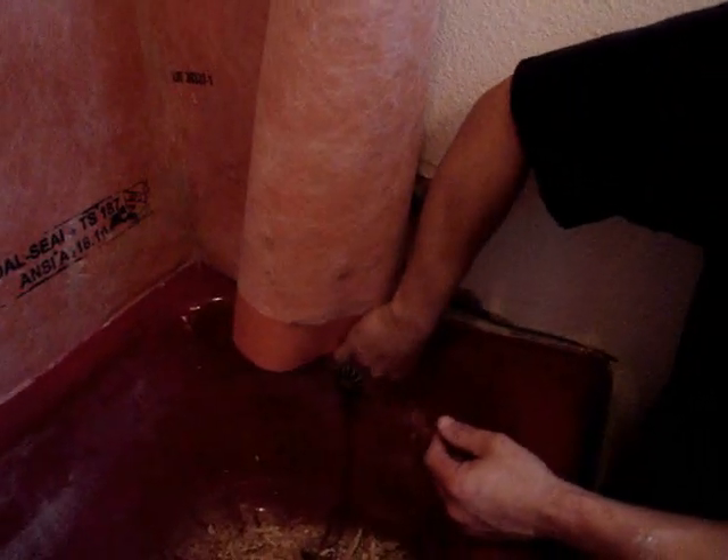What we're doing is, first off, we've just had sheetrock walls, much the same as you see right here — a typical sheetrock bathroom. It is sheetrock with green board, which is a water-resistant type of sheetrock, and it's been textured and painted. We've cut away all of the bad areas down low everywhere, and we've taken out some of the rot here. This is not glued up yet, so we're going to peel this back and fill it in with mortar. We didn't just use regular mortar — we used a high-grade premium thinset mortar that is modified and has latex in it, and it's made for bonding to paint.